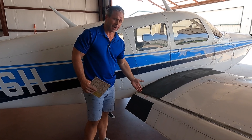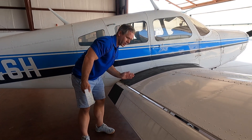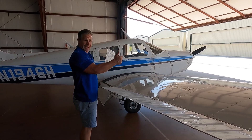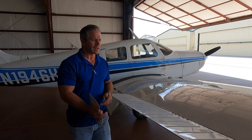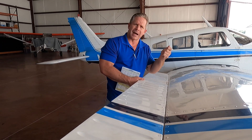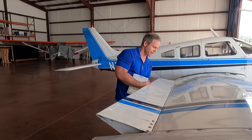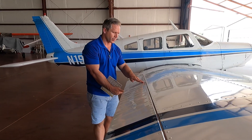As you can see, the flaps have been dropped. Raise and lower to ensure there's not much play, and check the supporting hardware on the three points. For your ailerons — if this goes up, the yoke goes over like so, verified. I look at the other aileron and it should be down. While holding it up, feel the control rod underneath to ensure it's somewhat tight — you don't want the control rod bouncing around. Hold the aileron up when you stick your hand in the pinch joint. Now with my hands clear, I inspect the piano hinges and supporting hardware to ensure the aileron is good to go.